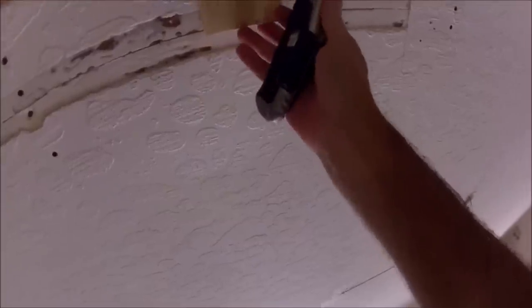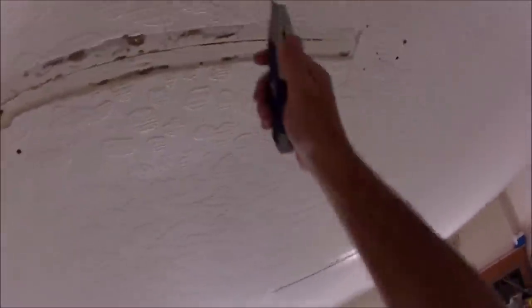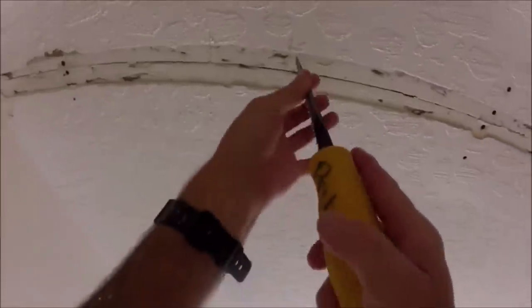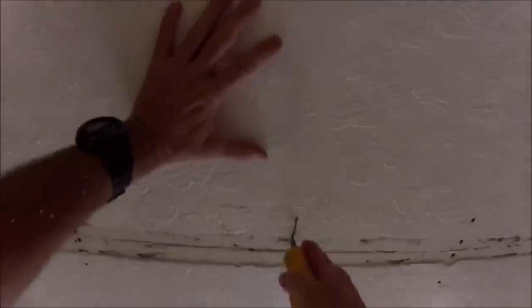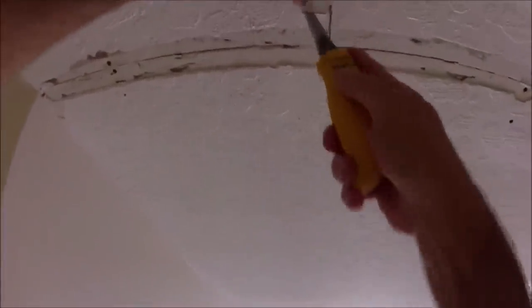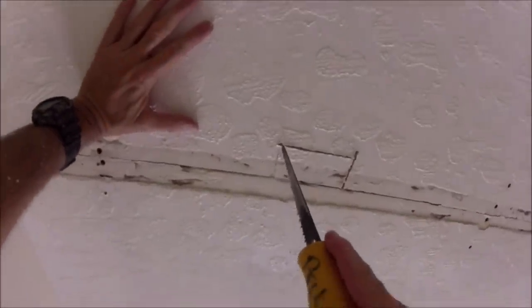I put the guards on just to seal any dust, and as you can see the drywall is a little gouged from removing that tape joint. Next, take your keyhole saw and just cut the scores. It doesn't have to be perfect because you're going to reuse this little piece that you're cutting out — it's going to fit perfect as long as you don't break it, so be a little gentle with that.